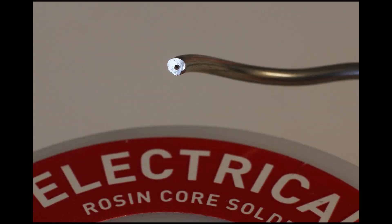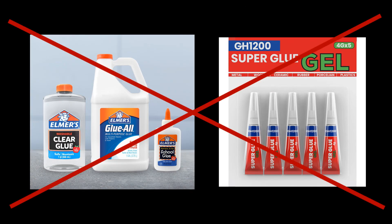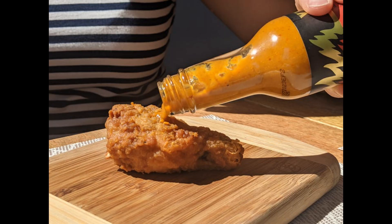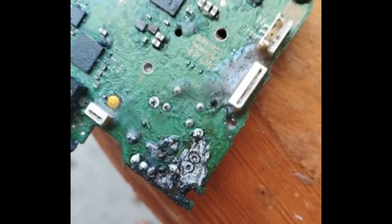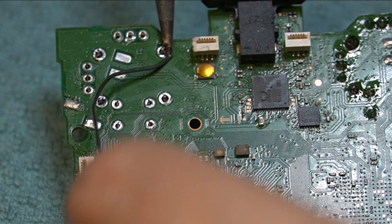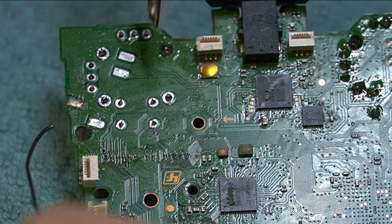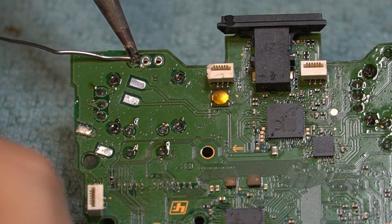If you look at a cross section of the solder from the end, you'll see the flux right in the middle. When you melt solder, the flux melts too. In those few seconds, the flux is cleaning the site where you're about to solder, guaranteeing a good connection. The smoke from flux is not pleasant, so you will want a small fan or filter if the smoke bothers you. Solder is not glue. When I see people starting to solder, I see them try to melt some solder onto the iron and then dab the solder onto the parts — it never works. It makes a mess, the connections are poor, and you're burning off the flux before it can do its cleaning job. The correct order of operations: touch the iron to the board and the wire, then feed solder in from the side. The flux goes in, cleans the area, the solder melts and flows easily, finding all the nooks and crannies, getting down into the hole, following up the wire — then you pull the iron away and you have a beautiful joint.